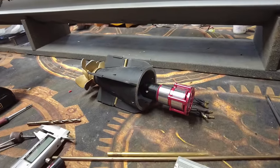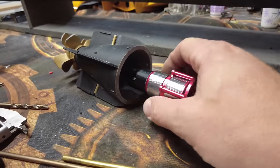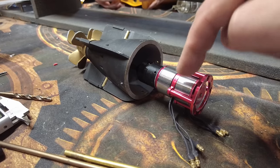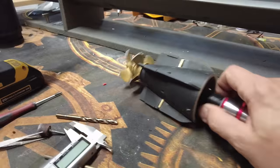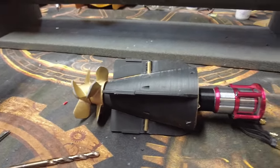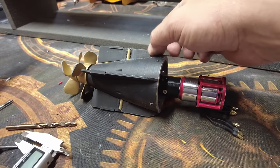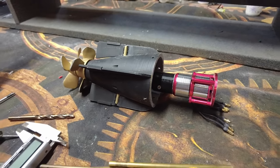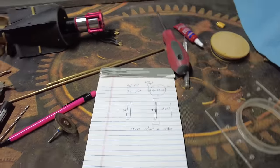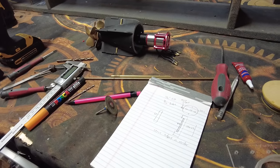This is the first go at the contra-rotating motor assembly. This is the connecting assembly I fabricated that allows the rear motor to bypass the front motor to power all of the propellers individually. I need to make a mounting bulkhead that goes across, holds it in place, and also encompasses a servo that will go forward to activate the rudders. I've done my sketch and I'm going to make those files this afternoon, get on the printer, and hopefully have it printed out by tomorrow morning.